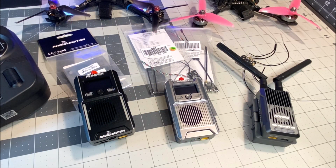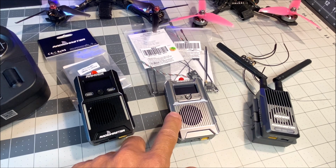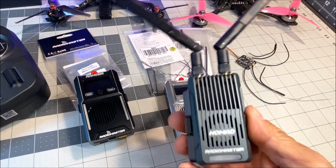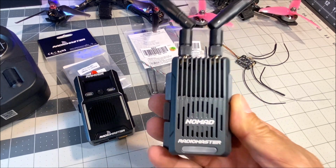So if you are like me and you are more than satisfied with just the 2.4 GHz ELRS protocol technology, that is fine. But if you weren't and have switched to the low bandwidth of the 868-915 MHz for the higher penetrating and farther reaching protocol systems, and you wish to have something even better, well, now you can switch to the Gemini technology and maintain a stronger link in areas with lots of RF noise. Perfect for freestylers, racers, and distance flyers.